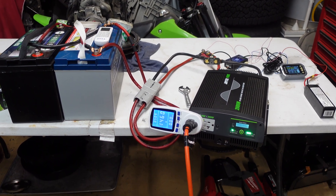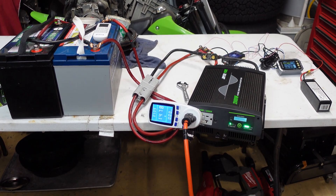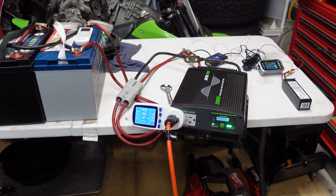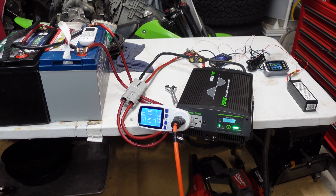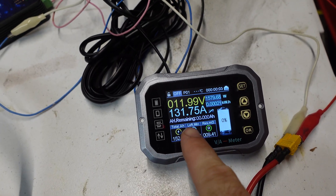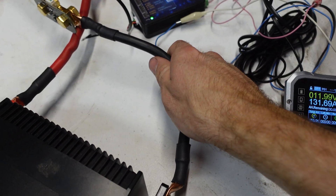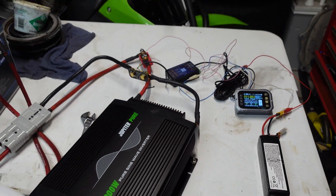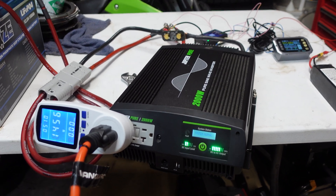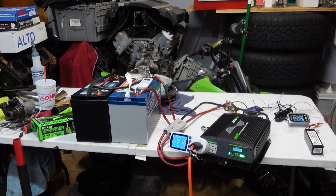I'm very happy with how this performed. If you're looking at this inverter or some cheap batteries on Amazon, I'd say give it a shot. If you wrap it all up with a charge controller and maybe some other components, you'd have a very nice solar generator capable of powering whatever devices you want. Keep in mind, if you're doing 12 volts that's a lot of current — that's why people go 48 volt, because at 48V that 1500 watts would be a quarter of the amps on the wiring. Anyway, that's it — I hope you enjoyed it, let me know if you have any questions, and I'll see you on the next one.